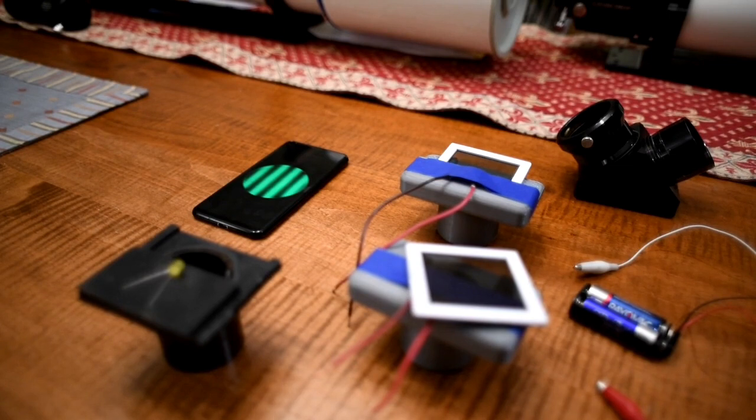Okay, Jeff, before we get involved in having you describe to everybody what type of equipment they might need to do their own testing, could you give us an assessment of the SD150 F8 Fluorite Doublet that you previously tested here today? What's your assessment of the optics? Actually, it's a wonderful scope. The spherical correction looks just about perfect. It's got a good smooth figure, and the color correction appears to be superb. When I was racking the focuser in and out, I didn't see any sign of astigmatism at all, and it's a wonderful sample. It's a high-end, high-tech, excellent example of a fluorite doublet.